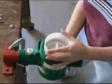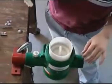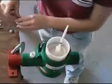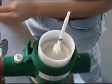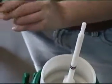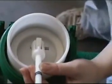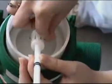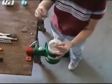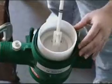Pin the motor pump connector stem onto the motor piston. Secure the pin with a split washer pushed over both ends and into the grooves. Place the cap O-ring onto the groove in the motor body and screw on the bottom cap, being careful not to knock the ring out of the groove and pinching the O-ring.